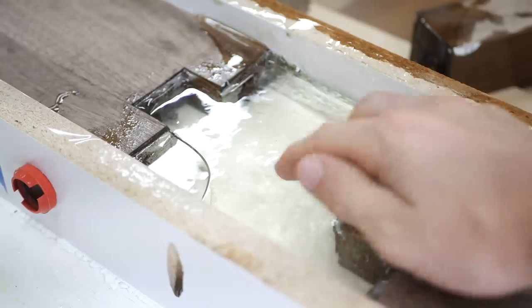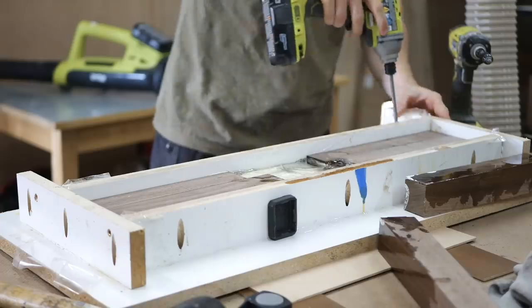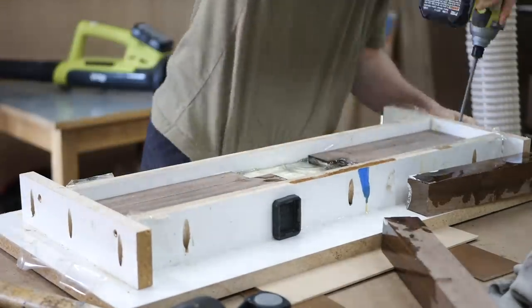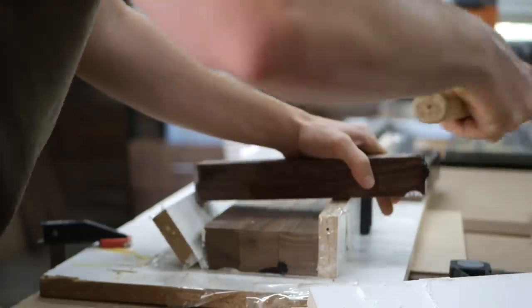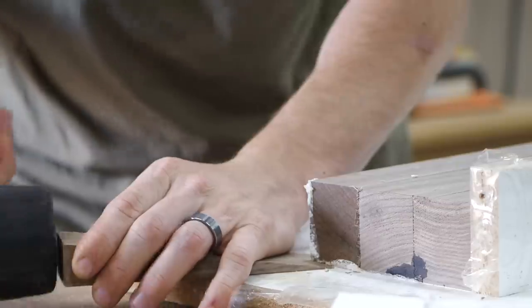After letting the epoxy cure for 36 hours, I went back and was disappointed to see that there were massive cracks in my pour. And honestly, I'm not sure what I did wrong here, but if I had to guess, it was either doing too deep of a pour, even though it was well within the guidelines of the deep set epoxy, or that I did the pour in weather that was too hot for the recommended pour temperature.